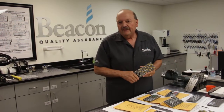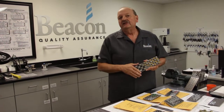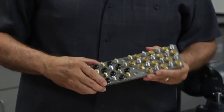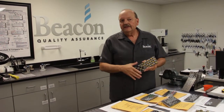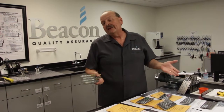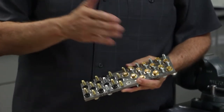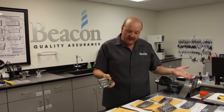So what's involved in the HE performance test? Well, first we have to replicate the stress condition that these parts might see out in the field. We do that by driving five samples into certified test plates to a point of failure. Then these values are recorded. Now the critical part comes: calculations are done to establish a seating torque. Then eight samples are seated, torqued, and left in that stressed position for a minimum of 24 hours. After 24 hours, they're re-torqued and checked for failures.